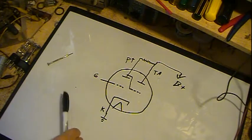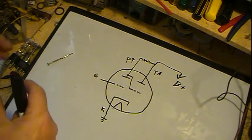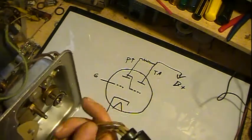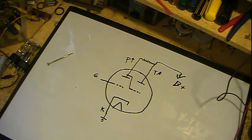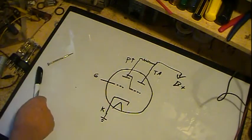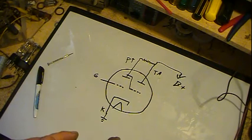But if you do have a tube that doesn't seem to be wanting to work very good, check that resistor. And like I say, it's usually in the socket or right at the socket. And the older style where they had the cup-like socket that fit on, in other words, this style like this, it's actually literally down in the back end here. It's down in there. You actually have to solder and unsolder them with them in place. There's some newer ones where they had just a socket, wasn't molded up like that, and then it's a little easier to get to the resistor. But check that resistor, and that's usually your culprit, especially if the tube tests good and everything. And in your tube tester, a lot of them will go ahead and test the triode, make sure it's operating right, and then they'll do a test of closed and open.